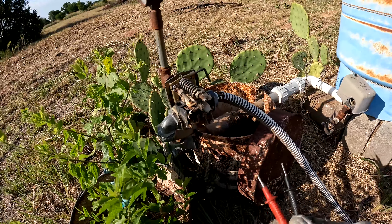These two are coming from the pole. If I go to these two going out to the pump, I've got nothing — that pump's not running. Moving back to the leads coming in, it jumps back up to 240. So I'm getting 240 out here at the well head, but when I move over to the pump side I get nothing. There's no transference of power through this junction, which is fine — that can be replaced. I don't even know yet if the pump itself works.